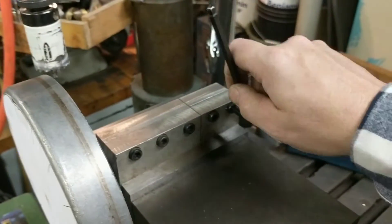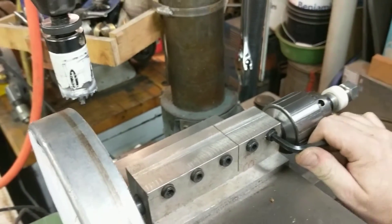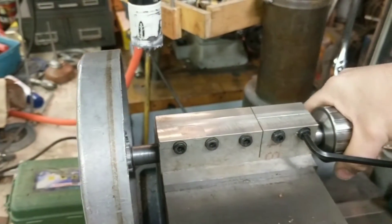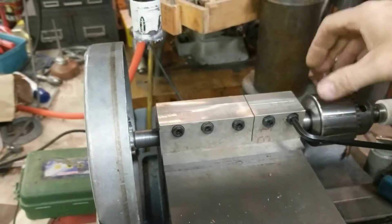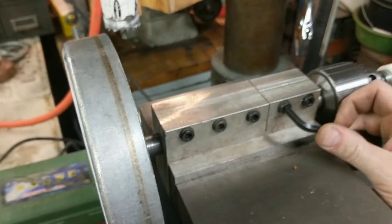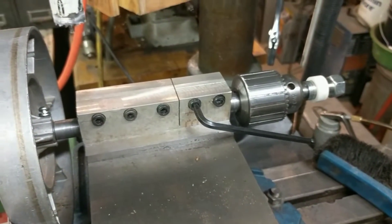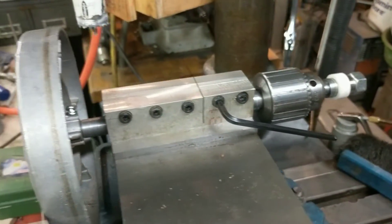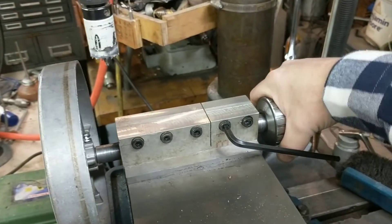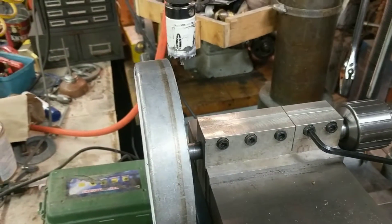At that point, I lock this screw here, which locks the shaft down from turning. The shaft can turn until I lock down these two screws — I did two for overkill, though last time I realized probably only one is really necessary. I'll lock down one or more screws, then the shaft cannot turn, and then we can run the table back and forth through the milling cutter.